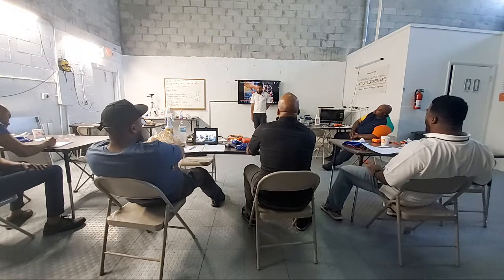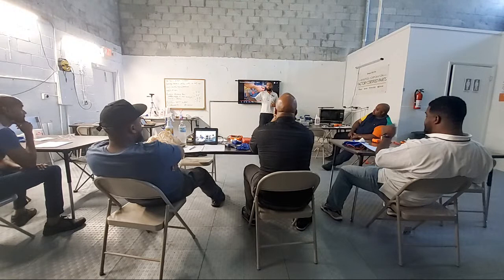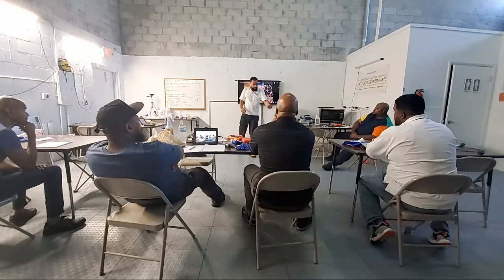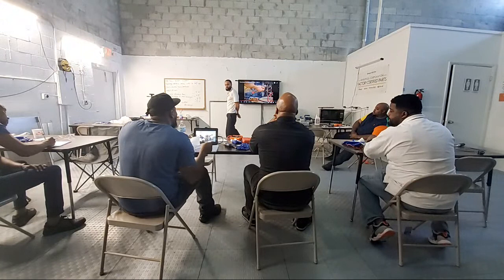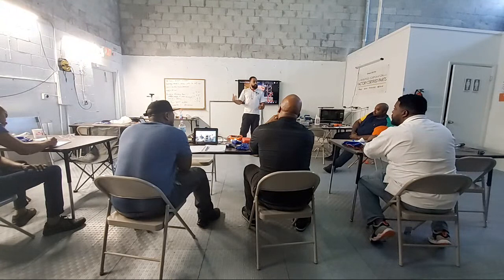This happened to me, I've been psyched out by a condenser fan motor. The vibration tricked me and led me to believe my compressor was running, and it wasn't. So for sure, verify that your compressor's running. Put your hand on it, take an amp clamp reading. We said on the screen what the amperage should be. Talk about it, Peter. I see you reaching there for that number. 1.5. That's it. Yeah. Good job. We did an amp clamp. We felt that compressor. We know it's running. We know that condenser fan motor is running.